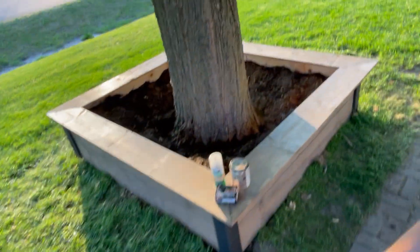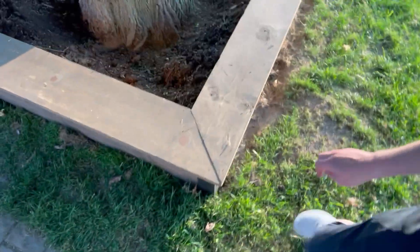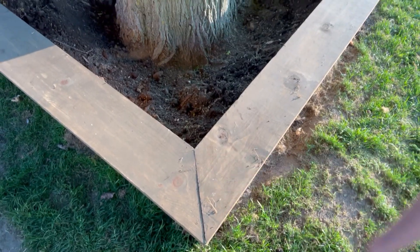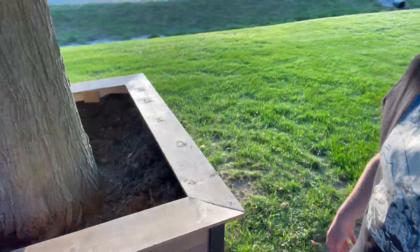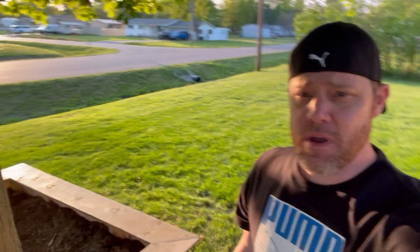The hardest part when finishing was the top — the 45-degree bevels came out pretty good. Of course, you'll have wood that's cupped or bowed a little, and because it's not a perfect six and a half by six feet, you'll have some slight gaps. You can use wood filler or put in a few slivers of wood — there are always ways around it.